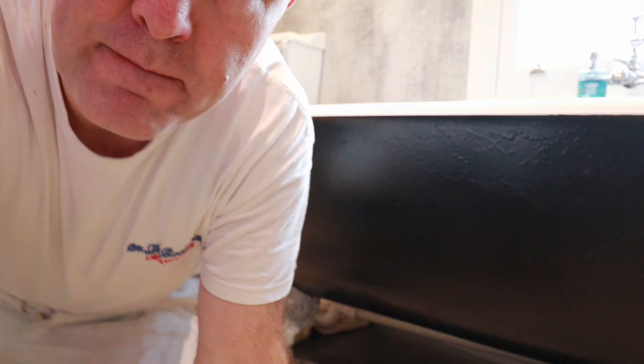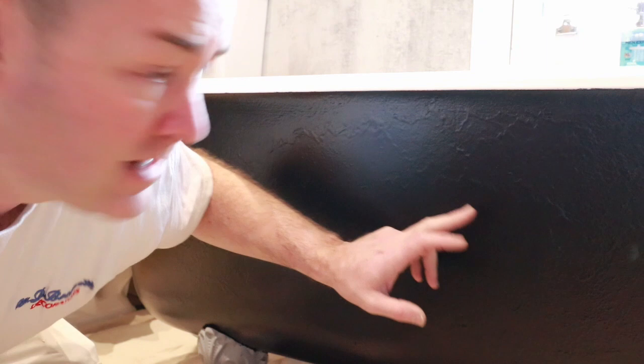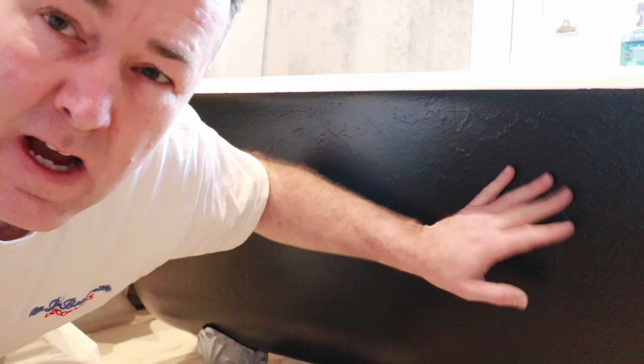Now, when I left you yesterday, because obviously I've given it time to dry, I gave it a second coat. Zinsser All Coat Exterior, that's covered lovely now. I don't know whether you can just see on camera, can you see the texture? Well, you've got the texture in the cast as well as the bad runs that I was telling you about, the historic runs. I'm not worried about that, because by the time I've got a marble finish, you're not going to notice it. And what I didn't want to be doing is sanding it down, because it's not like getting a smooth finish like on a front door or anything. It's not that sort of finish we're looking for. It is what it is. It's a cast bath, so it will have the imperfections.